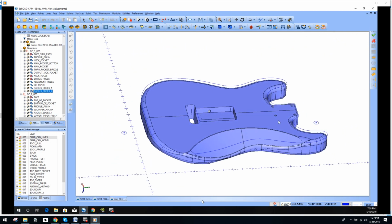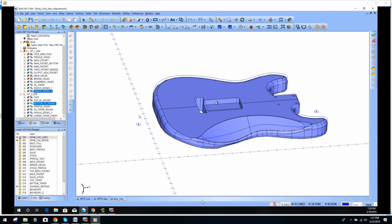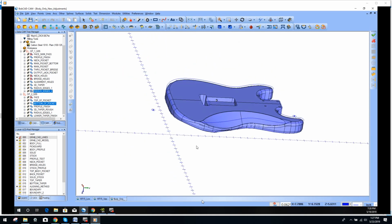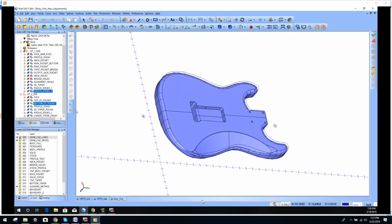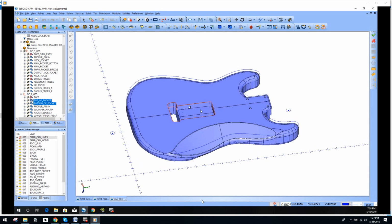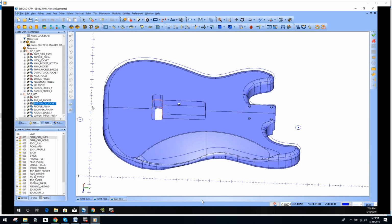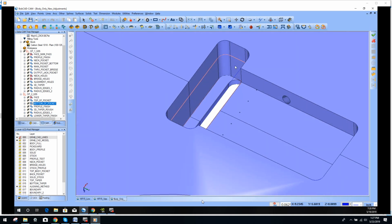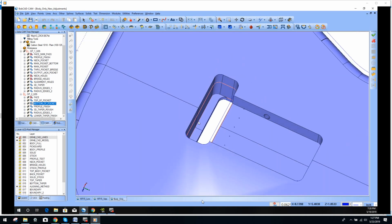So then, like I said, it gets flipped over and uses pins in those holes. And I think on op 1 he's putting some clamps in the corners because it clears. And you can do the same for op 2, but you can also tape this body down as well. So op 2, do this level down to that depth. This pocket down to that depth in there. If you can see that little, it's basically just that edge because we roughed through on op 1. So I'm finishing that.